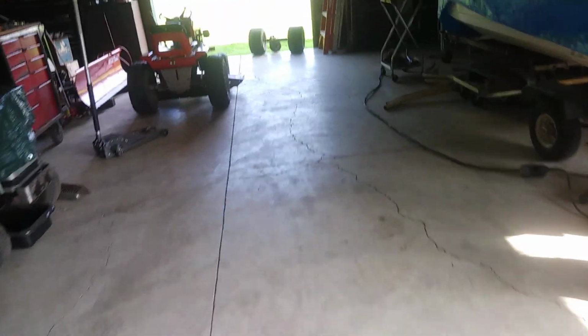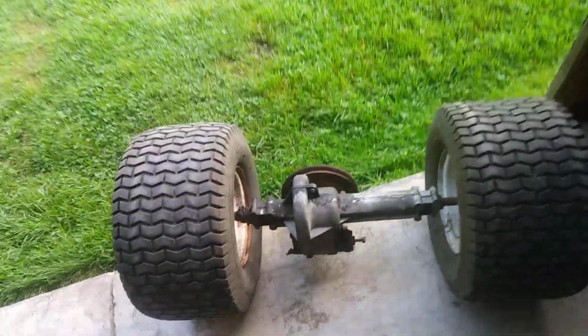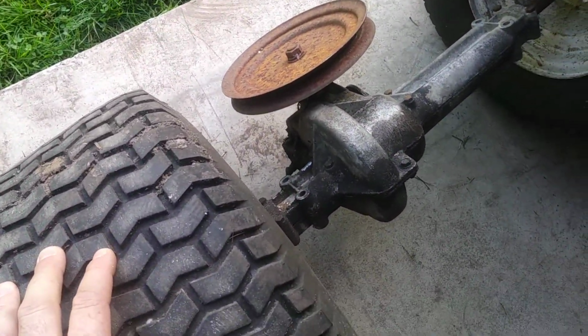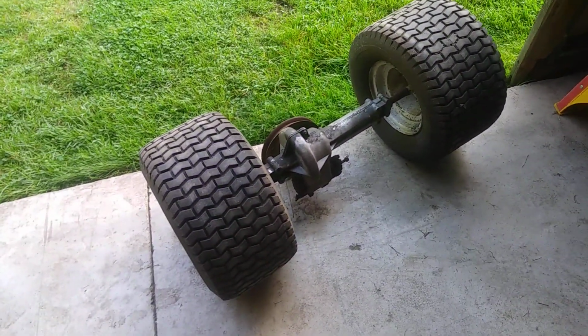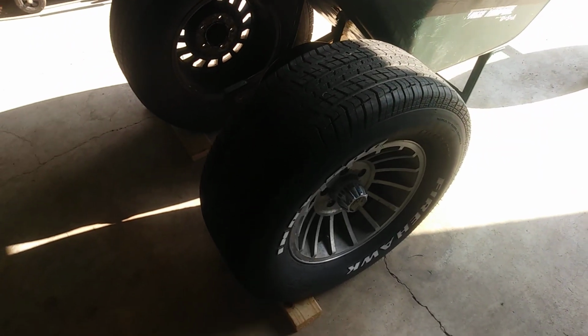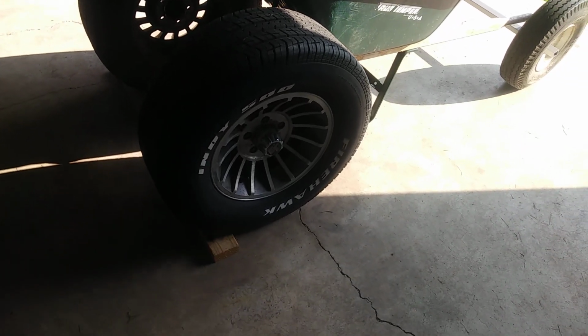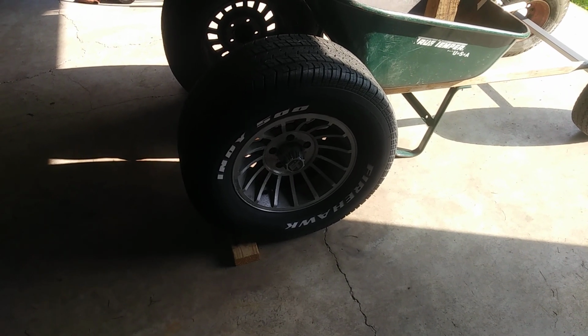But one thing, I don't know how this would handle spinning up at high RPM. And I didn't realize it's already womped out pretty bad just in the stock configuration. There's tons of play and everything. But the reason I wanted to use that is so we'd have reverse and a differential. But it's for sure not going to work with the weight of these and the size of them. I think they're like 10 inches wide. So I think what I'm going to do, these were on the back of a V8 S10. So it's 5 by 4 3/4, I think.